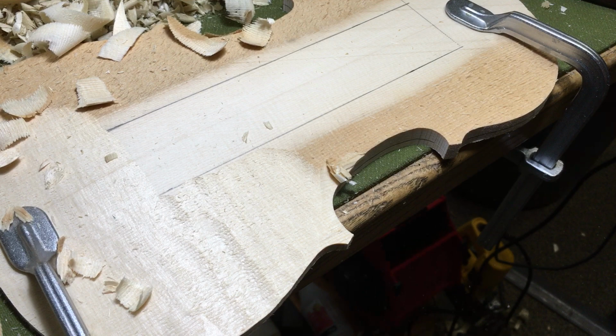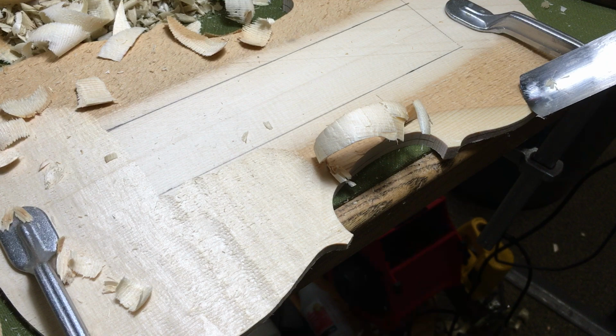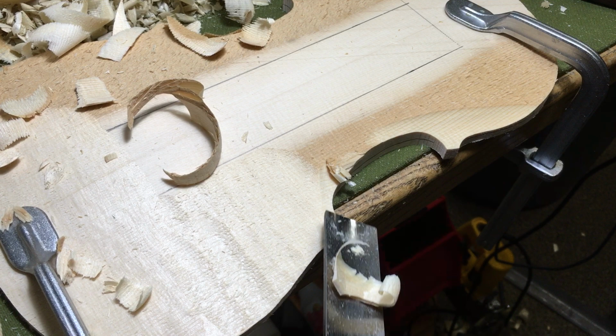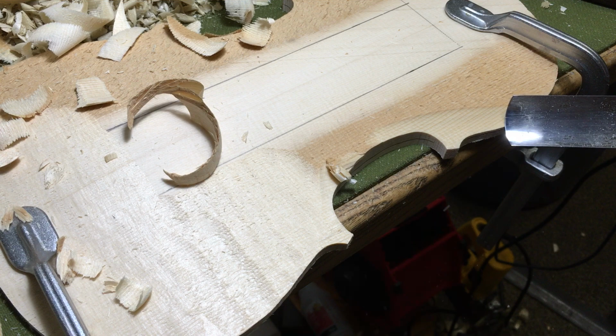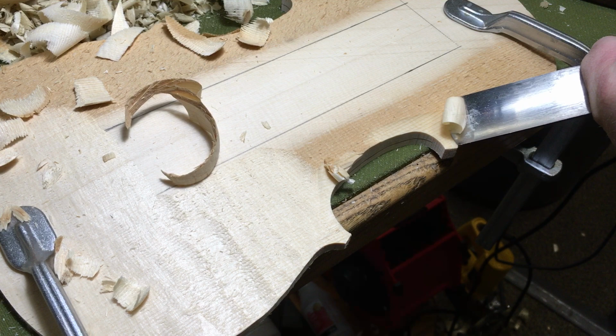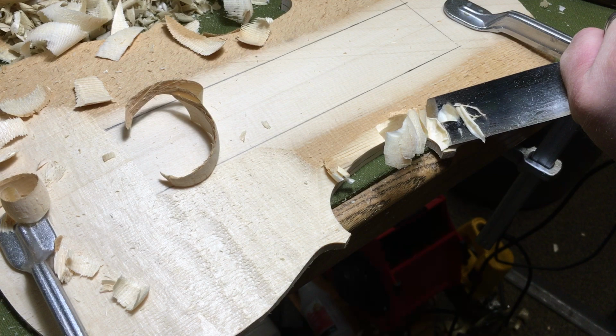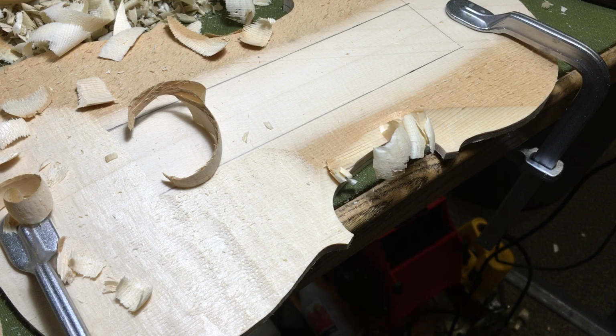I'm going to come in from this side. I'm coming in from different directions because of the grain of the wood. As you carve around this way, you're cutting off the grain that's in the vertical direction. If I try to carve in this way, on this side, it'll actually just dig. Whereas if I go the other way, it does a really nice smooth cut. You'll see those little curls coming up. That's what I'm looking for. Okay, and you can see where that grain changes, because all of a sudden it just stopped. Now we're going to come in from this side.